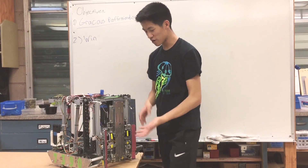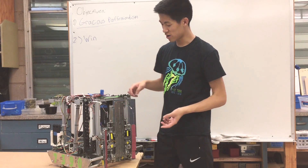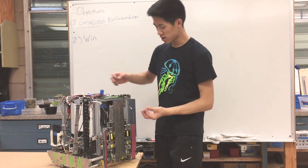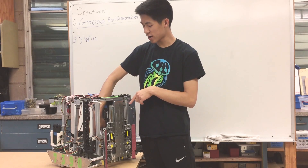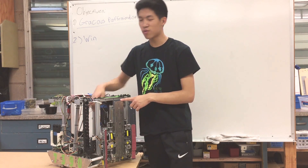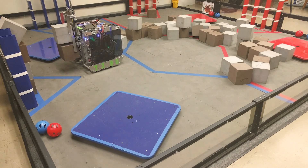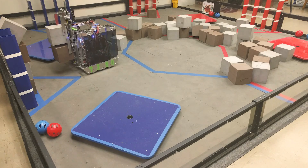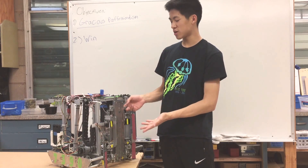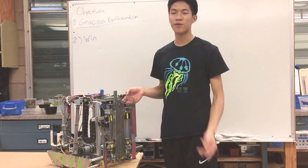For our dual chopstick glyph, which is basically our glyph lift, we used two main pieces of aluminum which we CAD'd and cut. We have it attached to a linear slide, driven by two 20-to-1 motors. From there, we have four servos controlled in pairs that can grab each glyph independently — the first stage grabs and lifts up, the second stage grabs and lifts up, and then we can go drop it off in the box.